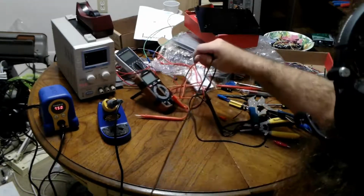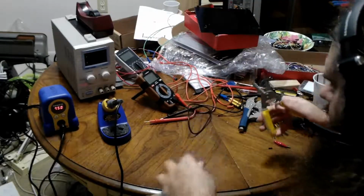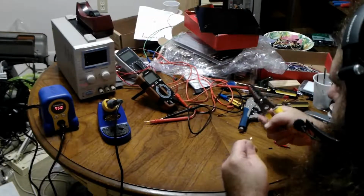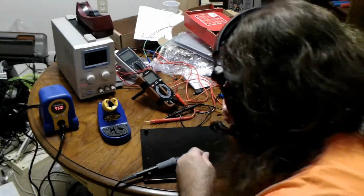Make it exist. So now I will take the spare negative probe, take the cap off, trim off that end, and I think we decided this was 14 stranded. Let's see. Yes. Check for nicks, and get her nice and tinned. Squeeze that together a little bit. All right. A tinning we go.